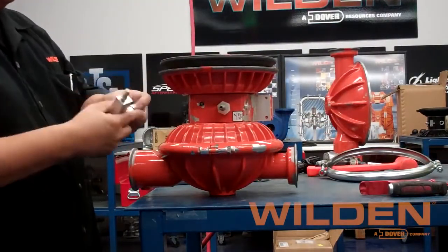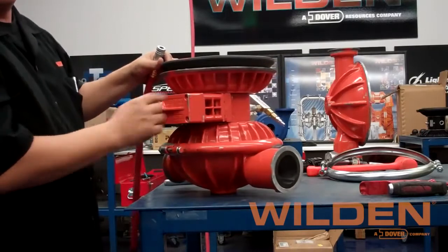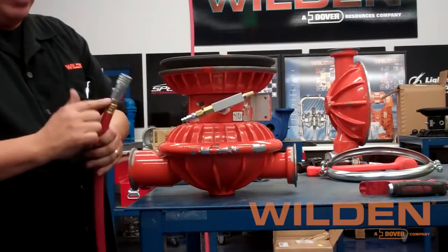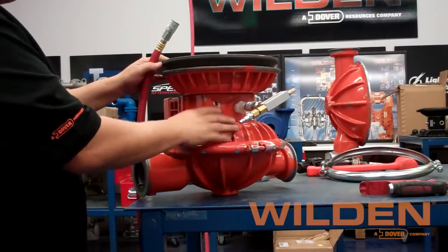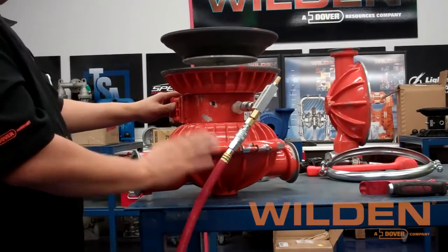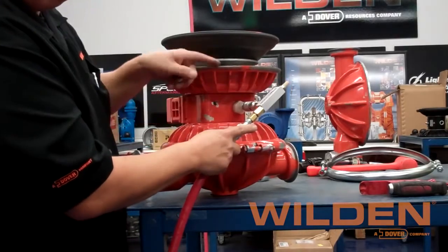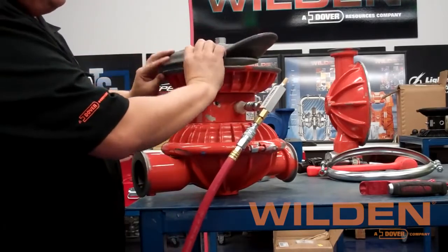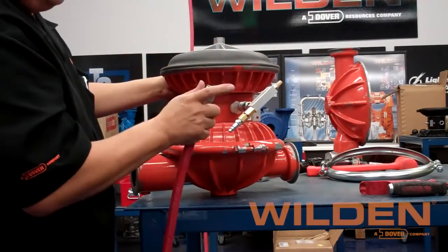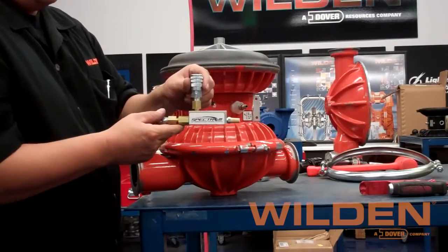With the Spectrum vacuum generator, you are able to do the same process using just the air already provided at your facility. Hook the vacuum generator up to the inlet or discharge depending on the position of the spool. Once air is supplied to the vacuum generator, you will see that it will lift the diaphragm by evacuating the air in the opposite air chamber. The vacuum generator pushes the diaphragm up — note that it drops just a little, so you will need to maintain air pressure to the pump until you have completed seating the diaphragm into the bead groove. With the shaft fully extended, insert the diaphragm bead into the bead groove, then disconnect the air and remove the vacuum generator to complete the diaphragm installation process.